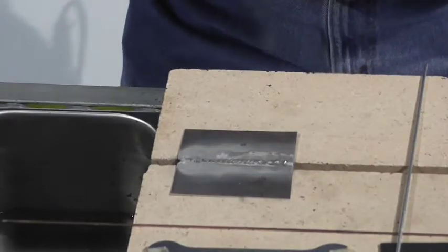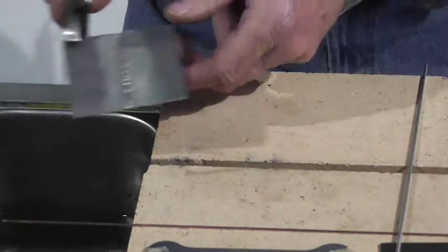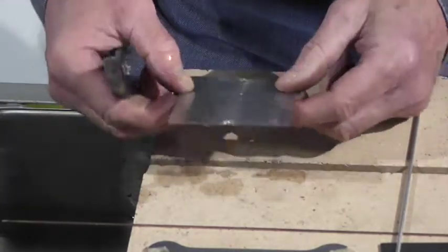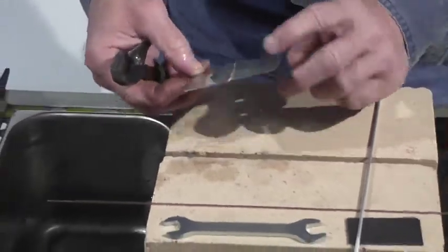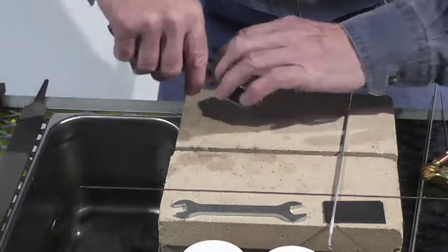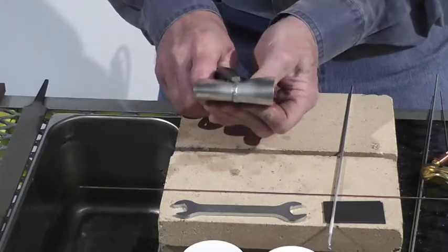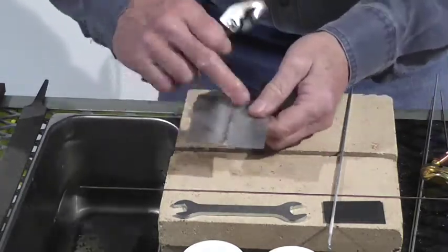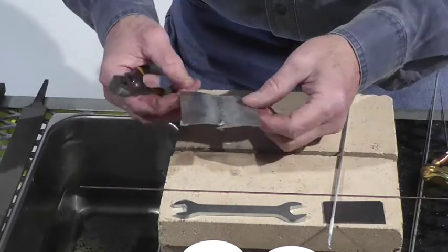You always want to wash that flux off. Now notice, with just four pounds of oxyacetylene, just how nice a weld you get — one hundred percent penetration, very little distortion. You can actually hammer weld, shape, form, and move that metal. So for a lot of you body guys, this is excellent equipment, because with TIG and MIG — if you weld with electricity — you can't do that. That's a self-annealing weld and that is the strongest weld on the market.